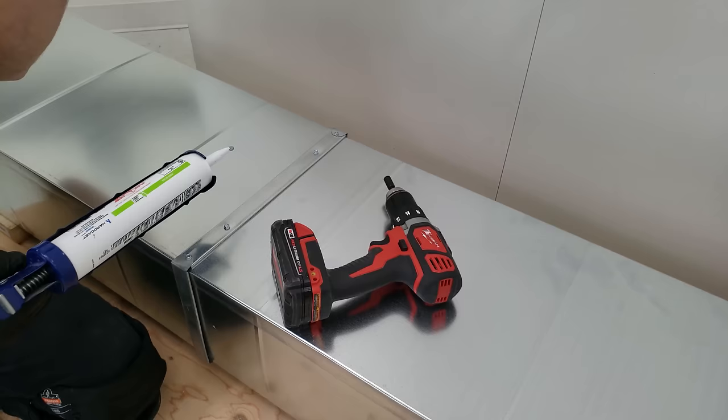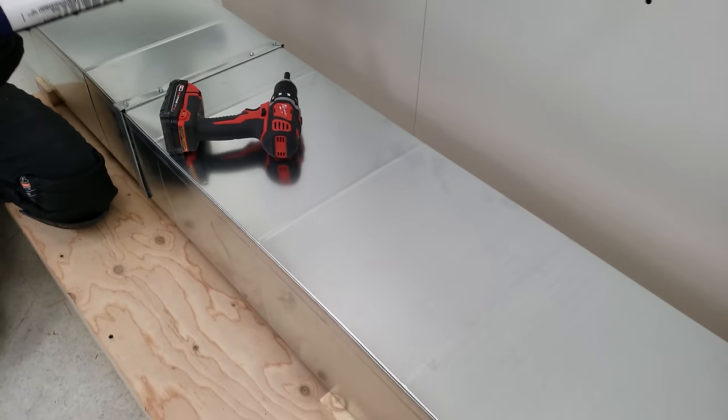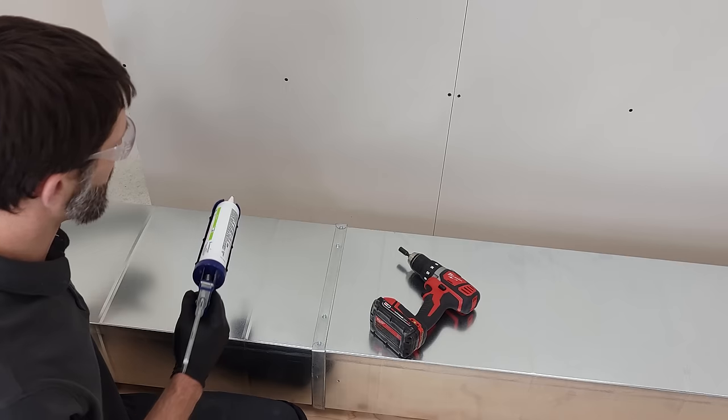You could do as many as even like say 24 foot of ductwork and just hang the whole section together with two or three tacks. This way it avoids you having to do this one little section at a time.